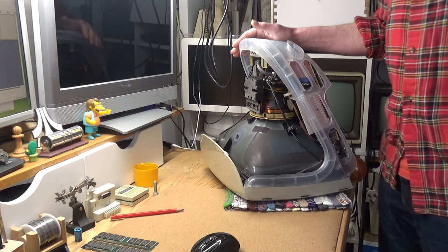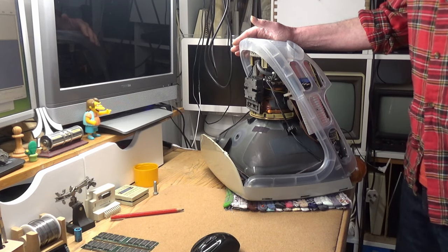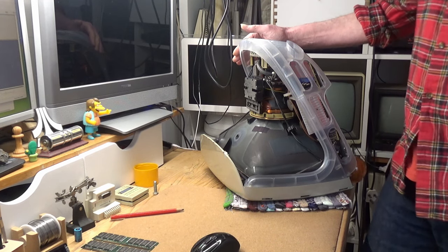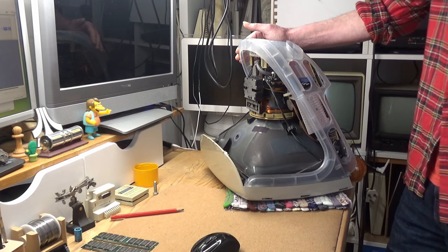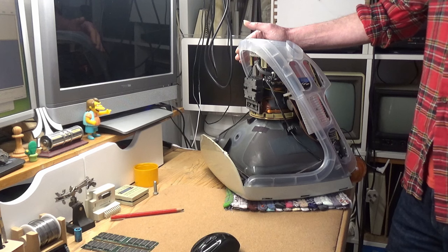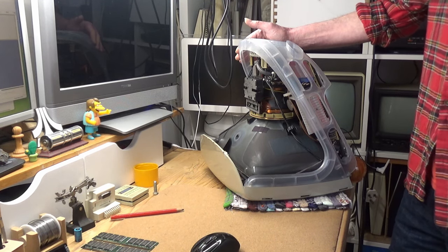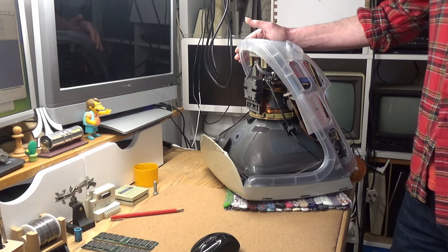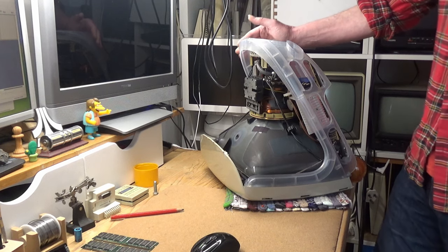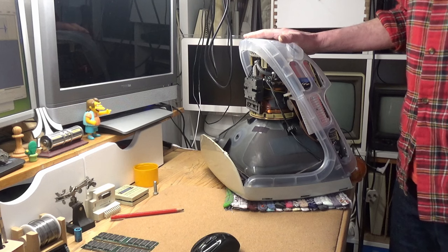Okay, so having come this far and having tested the fuse on the power and video analog board, the fuse is fine, which means there is a fault elsewhere on the board, and it's either going to be capacitors, or there's a very real possibility it could be the flyback. Now, if the flyback is damaged, if it's shorted, then there really is no going back from that. There's no way to repair it. I would have to try and source a new one. But we'll continue with the strip down.